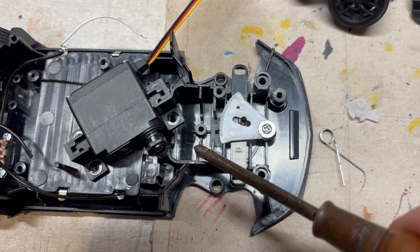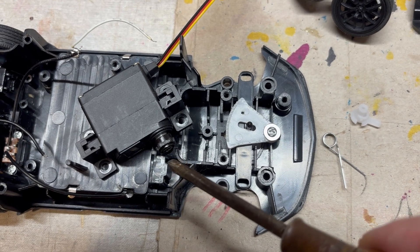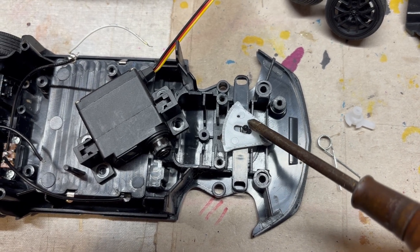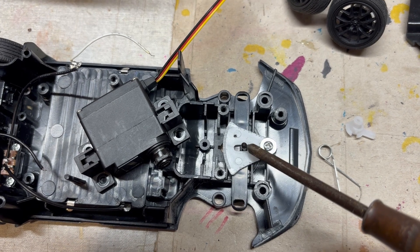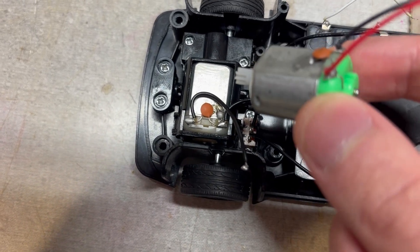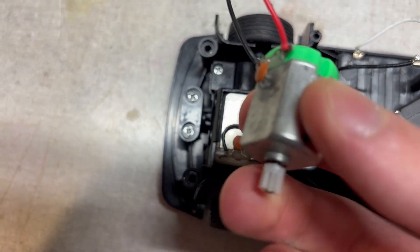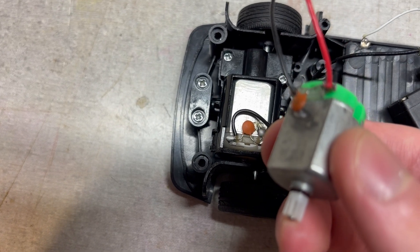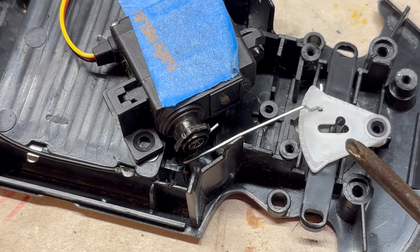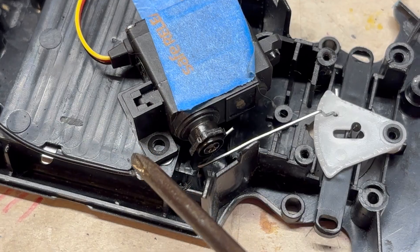Here's what I meant when I said I was going to move the servo behind it. I've drilled a little hole in the steering sector gear and there'll be a wire running to the servo horn. I've also removed the springing bits that comprise the return-to-center mechanism so the servo has total control over where the steering sits. While I was in there, I also took the opportunity to replace the drive motor with the one that was formerly the steering motor, because the green motor had a much higher cogging torque than the white motor, meaning the white motor will probably run smoother.